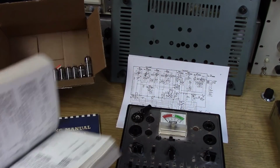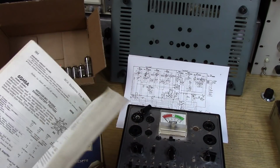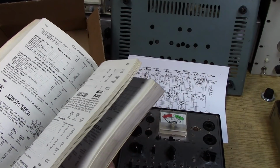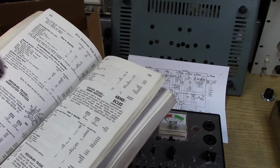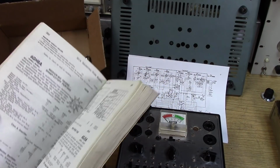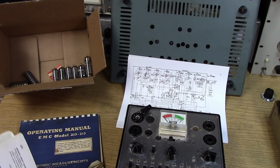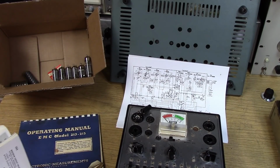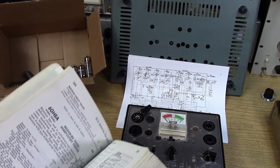Now, this technician, engineer, 13-year-old, whatever, has made a tube substitution, and I can't see any difference in the pinout. So there's something confusing about this. Why would they have two different pinouts for essentially the same base diagram? But maybe it has something to do with the structure inside the glass envelope. But I will indeed look for a 6BL8 in my tube stock, and I will test it against this 6GH8. It'd be interesting to see how both of them perform in the receiver.